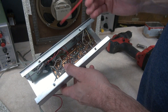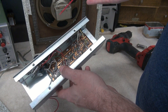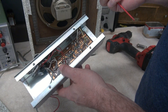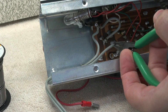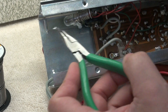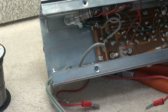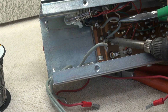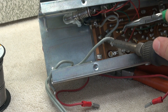There's really no other way to do it. Now another thing you could do if you really wanted is remove the circuit board completely, put in a panel, and build yourself a hand-wired amp. But in this case, we're going to go ahead and modify this one, because at this point it's really not worth much. As shown on the schematic, the 120 comes right down onto the circuit board — they have a fuse here on board that I've already disconnected. Then it goes through the AC switch on the back of the tone control. The other half of the 120 is right there on the circuit board. No power transformer, no isolation. So when I'm done, there will be no 120 direct on the circuit board, because we're going to have a power transformer.